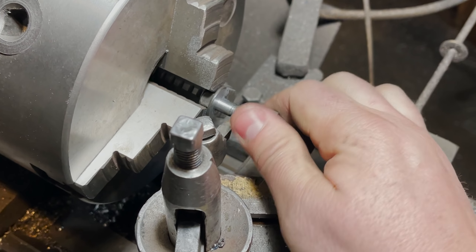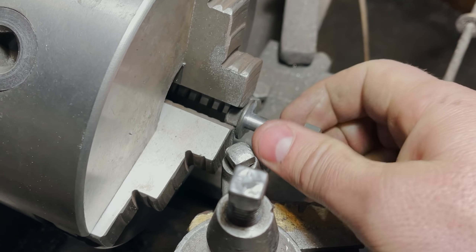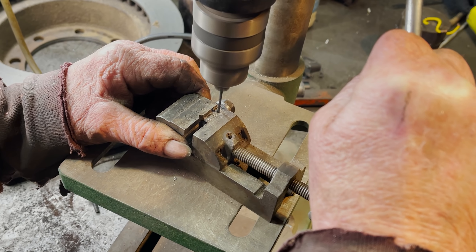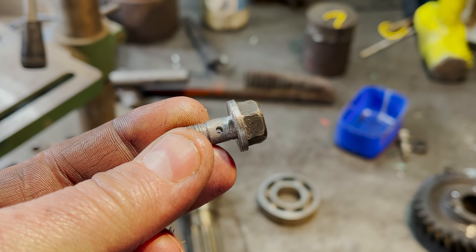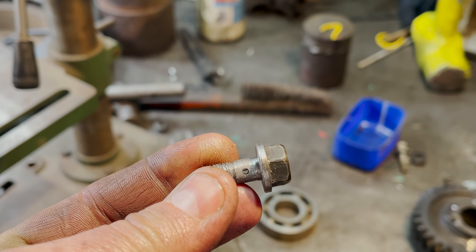Check this out — it's threading on. So we got through one side. As long as it catches the inner hole, it doesn't matter if it's exactly centered. We're through. Going to de-burr that carefully to get rid of all the burrs. There are two oil holes, so if one gets plugged off the other should still be big enough. Hopefully nothing plugs them off.